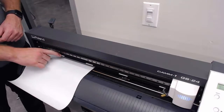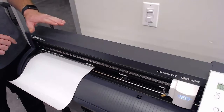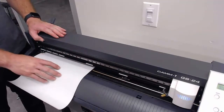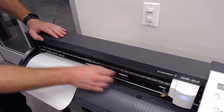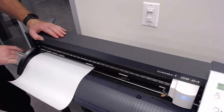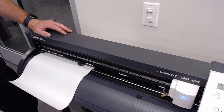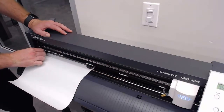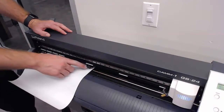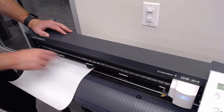You can see there are little white squares around here. These white squares are what the vinyl cutter uses to communicate to the computer where this vinyl sheet actually is. We need to make sure the rollers are over one of these white squares. If we have a roller in the middle, it won't be able to communicate with the computer where this sheet is actually located. We also want to make the most of the vinyl we have, so try to find the maximum outside you can.